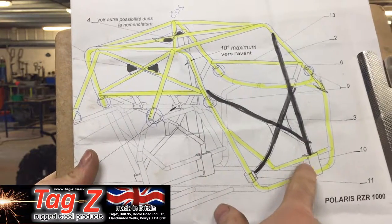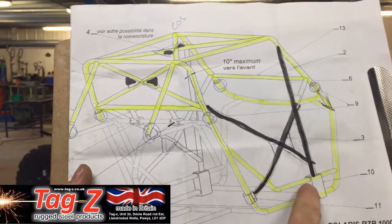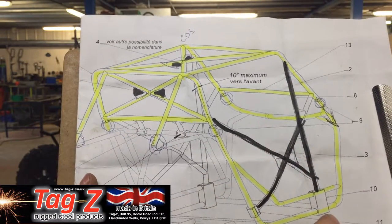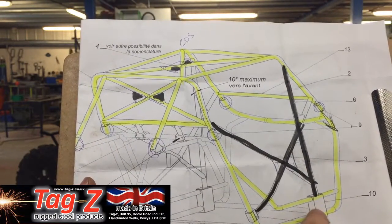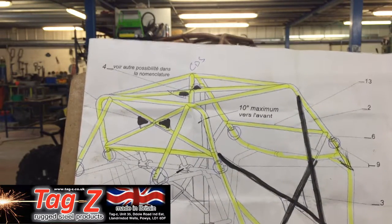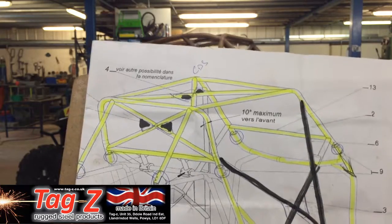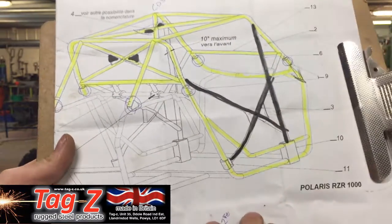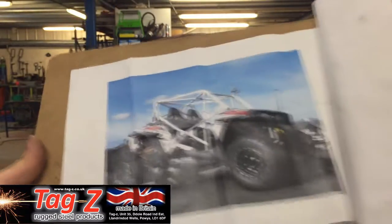Here, there is an existing one down the bottom. It's a very light duty one. But I don't think it needs to go to so much work. But the roll cage connects here, so I'm going to put a 5mm brace going from here up to here. Yeah, and it should look somewhat like that.